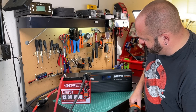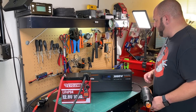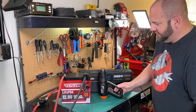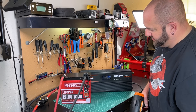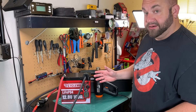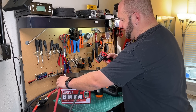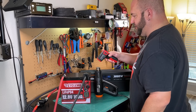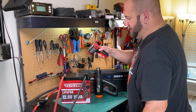Right at 120 amps — 121-ish, fluctuating a little bit — 1,330 watts. No problem. We let this go for a solid five minutes; the meter was showing 122 amps and it handled it like a champ. It's getting a little bit warm, but I suspect that's because we're right about the rating of these wires. We're at 92 degrees on the terminals, so not bad at all.